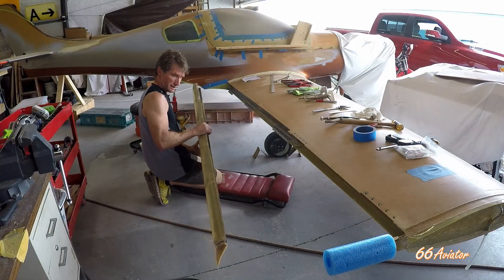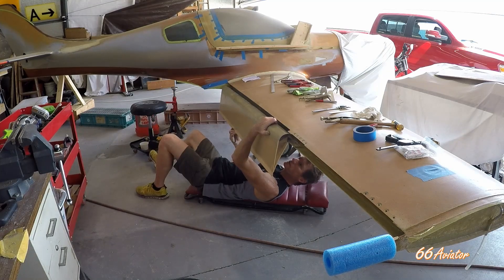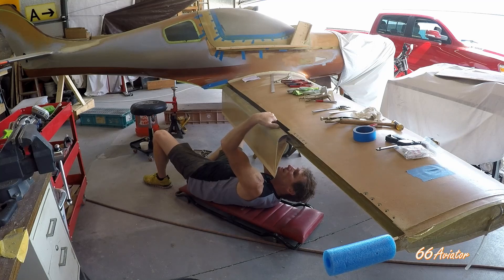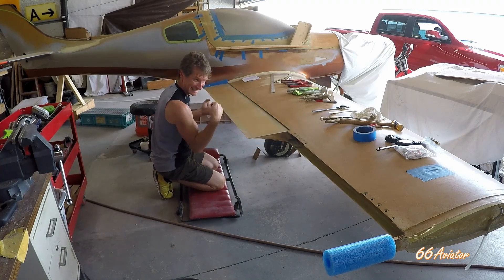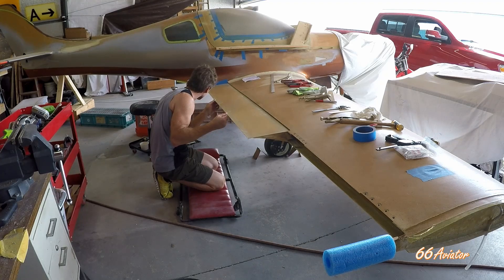Our leading edge is done now. It's curled over and tied to these little leading edge ribs that are in here. Just putting some Clecos in to hold it temporarily, and then I'll go back and put some screws in, but this is really a two-person job so it's a little tricky at the moment. That is beautiful! We have a flap and it's clear all the way down even in the reflex position.